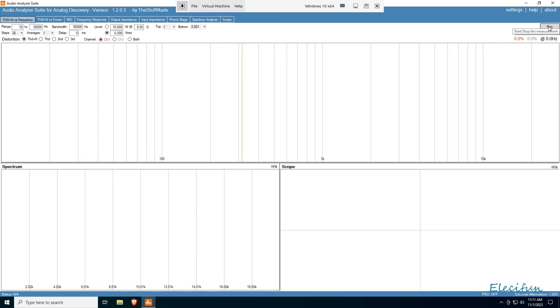Lovely. I wouldn't be able to tell you, this is that slew rate thing. This is the adjustment, how fast can it go up. Now, I wouldn't be able to tell you whether this is my measuring or whether that's the amp. And to be honest with you, there's not enough there to really complain about. Let's go to 10 kilohertz. Again, not enough. If it was all the way off or something, we might have a problem, but no, that's good. Now we're going to go to the top end, which is 20 kilohertz.